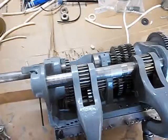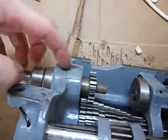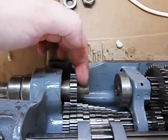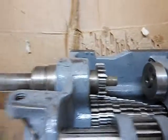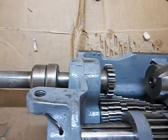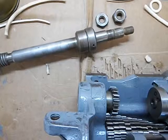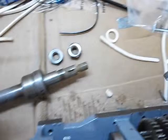This is the completed assembly. There's a pair of nuts that go on here to fasten the lead screw — this is keyed to the lead screw, and that's the lead screw itself. You can see it drives off the stack there. I'm not going to leave this in because I don't really have a handy way to support it. I also have to replace the woodruff key — at some point during disassembly it shot across the floor and I don't know where it went. That's a thrust bearing there.